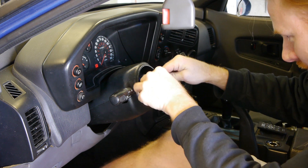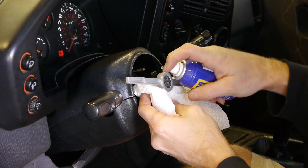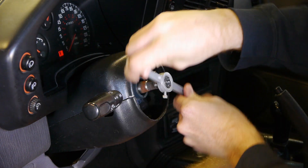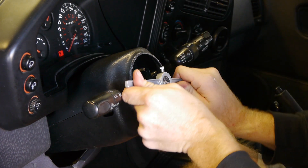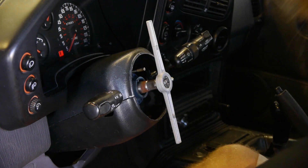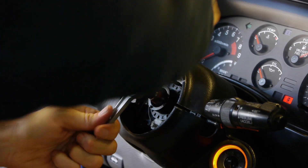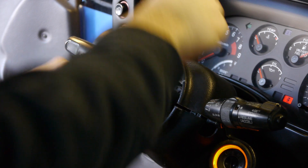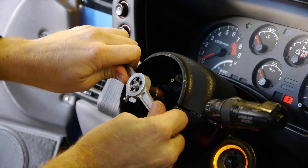It also says to add some cutting oil, like some WD-40 or PB Blaster. So just get that nice and lubed up. Like I said, go back and forth after every quarter or half a turn. That'll get all the shavings out and make sure it's not binding up anywhere. WD-40 seemed to help a lot actually. So we're just working this slowly, going back and forth — quarter or half a turn, back it up, then go again. It's looking decent. Now we're cutting deep.